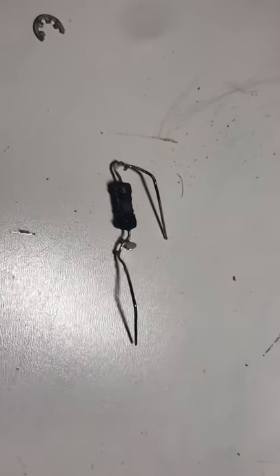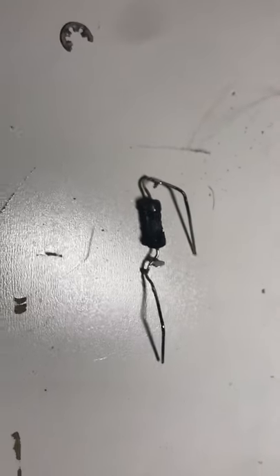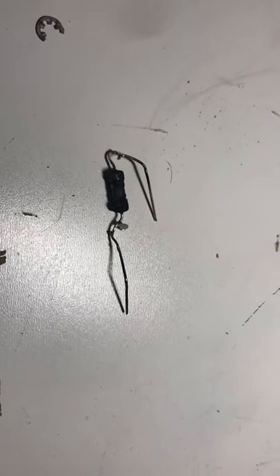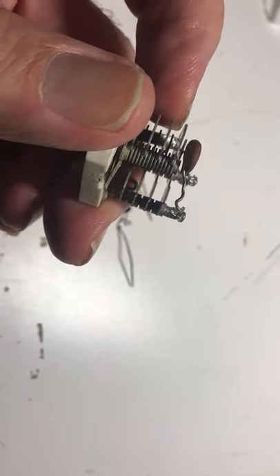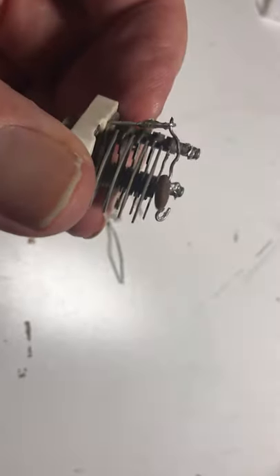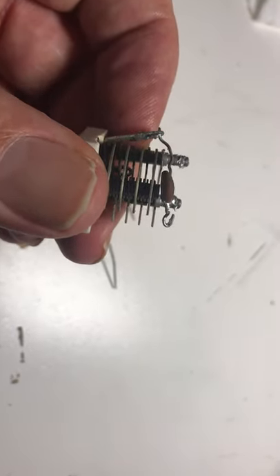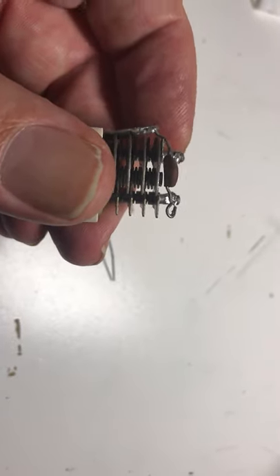It smoked that resistor, so I put another 680-ohm in there. Tonight I was trying to get the finals neutralized and I've never seen a greater show of sparks. This resistor smoked up — it made like two seconds of fireworks — and I finally figured out that on one side of this is 750 volts and on the other side is 250 volts. When this shorts, the plate supply at 750 volts goes into the 250-volt supply, and that must blow up all sorts of stuff.